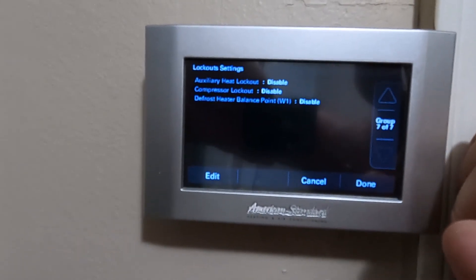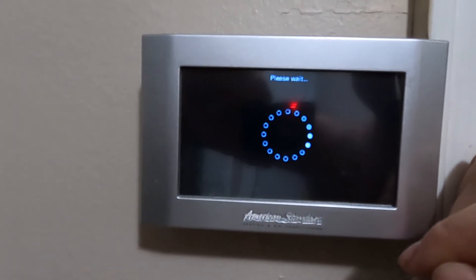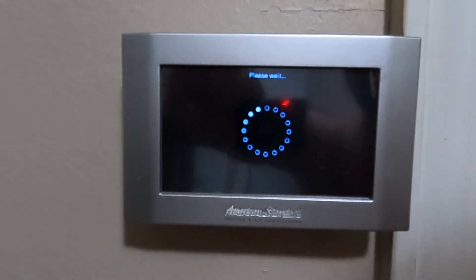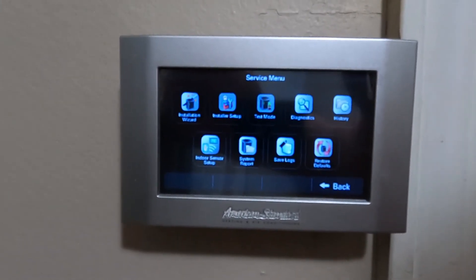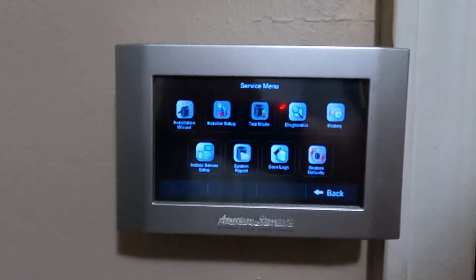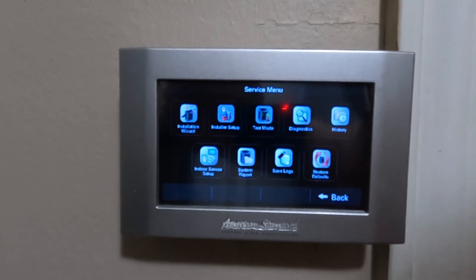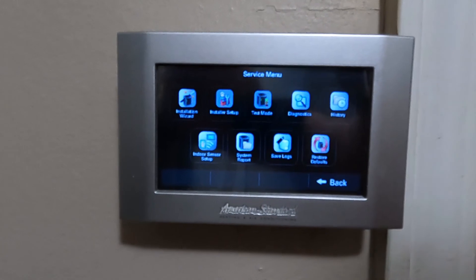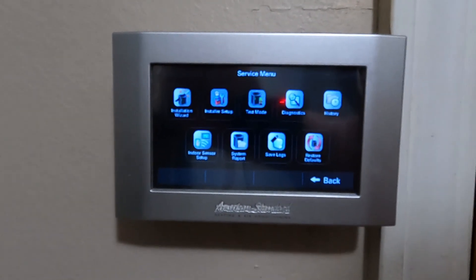Those are the lockouts, which I haven't changed. So to recap, the things you have to do to set up this unit: cut your BK jumper, don't hook up your Y wires, and then program your thermostat for the time delays you want. Hope this video helped setting up your TM6 with your BK thermostat. Next I'll do a video on checking static pressure so you can confirm what you have is what you want based on your static pressure and CFM. All right, have a good one guys.